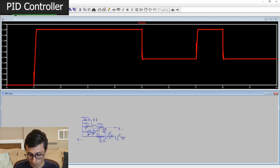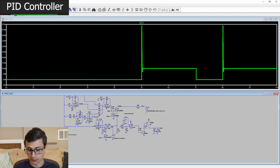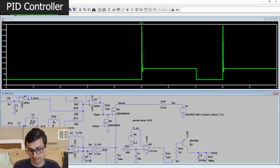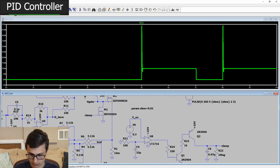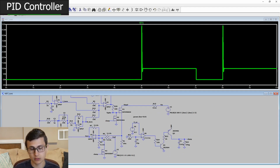However, all things considered, 200 volt input, basically no load, no resistor. That's not a bad fault current. I don't think that was limited by our 10 milliohm resistor. What would that be? 200 volts, 10 milliohms? I think that'd be 200. No, that'd be more than 200 amps. Yeah, that'd be lots and lots of amps. That'd be more than 2,000 amps.